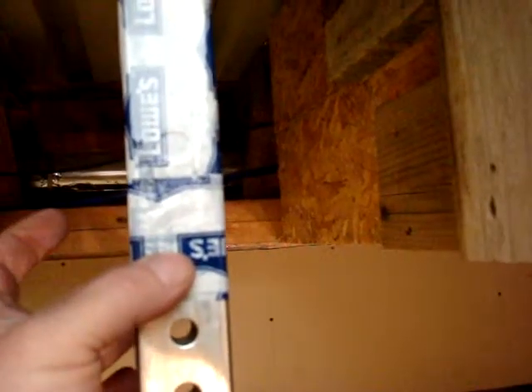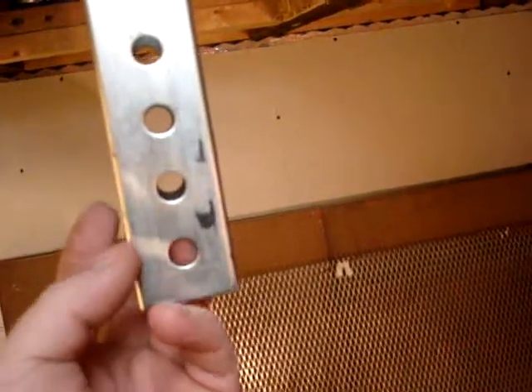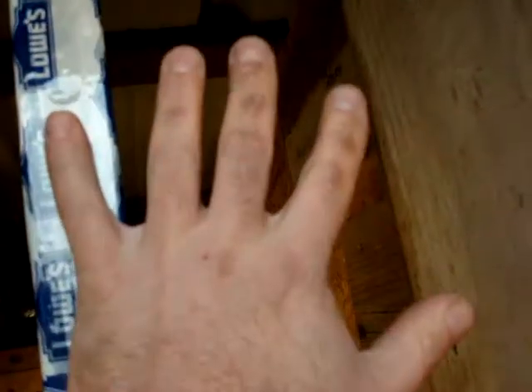After I finish the framing that goes in here, I'll be spray foaming all around it and wrapping this in insulation. So the air that penetrates the receiver for the tool down in here will go up inside, but will terminate here, where I welded it to this base plate. And no air will exchange between this area and the area inside the building envelope. On this particular custom fixture, that's what you have to do to make sure that you maintain the seal when you've got a penetration like that.